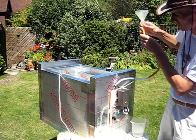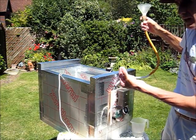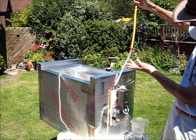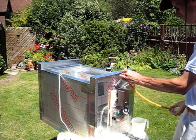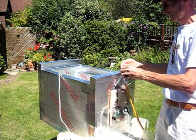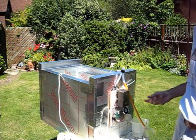One important design factor to mention: when I installed the radiator on the inside and the cooling block on the outside, I put the inlet and outlet tubes at the top to assist air in getting out. Even so, I'll probably need to spin the pump a little before it gets all the air out. It does look as though it's filled up as much as it can, so I'm going to hold over the tube as a temporary seal and bind a bit of tape around it, then start it up to flush any remaining air out.